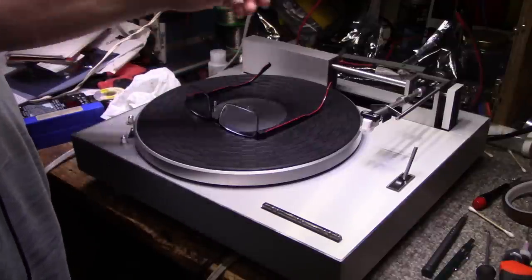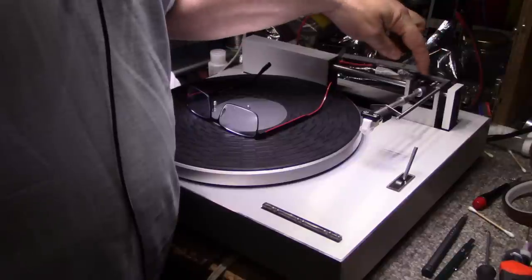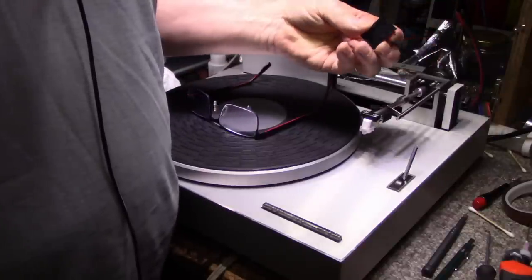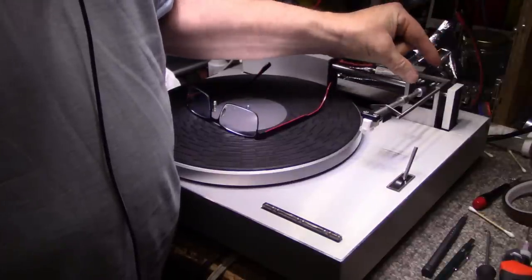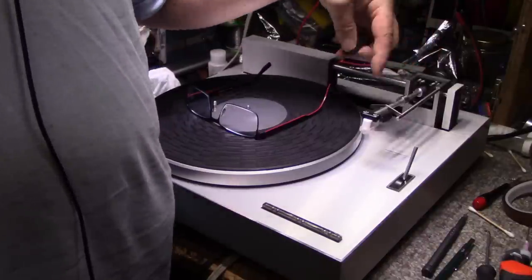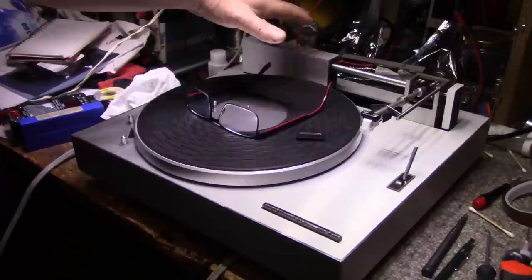The Rabco badge, I still need to attach that. And I have a feeling this Rabco badge is the secret behind my problem here with this yoke, this gimbal yoke thing here that's collapsing on itself. I think this holds it open. And if I put this on, I think it snaps into place. I don't see it was glued or anything. I think it just snaps in. And once it snaps into place, it holds those two pieces apart, and allows this mechanism to probably work properly. And I'd have to redo all my adjustments I made. So that's another thing I need to address. And then after that, I need to readjust everything because it would be all out.